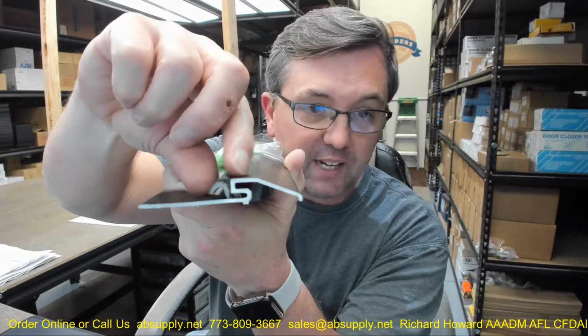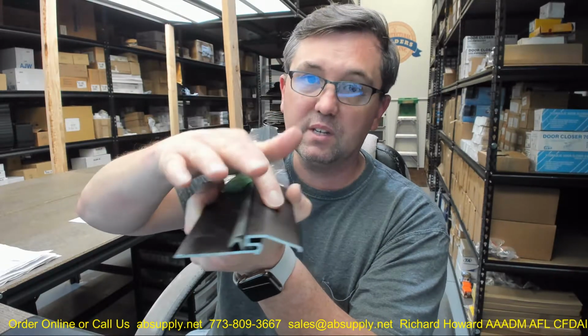I'm going to say probably not, because where the door is going to reside back to here, that Pullman latch is meant to communicate to this beveled end back here. Generally in a latch track, the height of this is smaller. So I'm going to think that you're not going to probably use this for that application. You would want one that would be smaller, and you probably are going to have to mount your strike on top of this threshold.